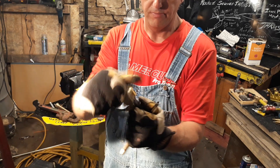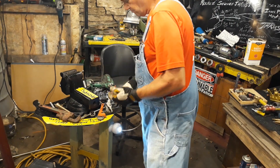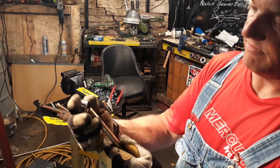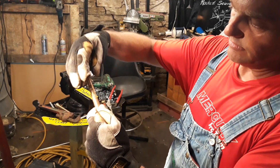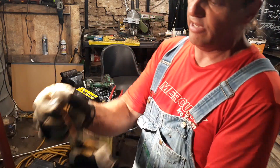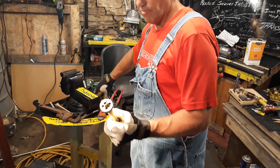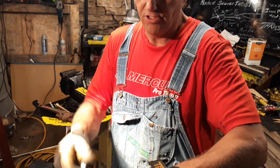You want to do it until you've got about that much sticking out, and that will allow your pipe to go all the way through. Then put your die on your threads — there are two directions these dies go in, put on the flared end, make sure it's nice and straight. Don't use a machine on it first — put it on by hand, turn as far as you can. You just want enough threads to get it through the end of the hex bushing.